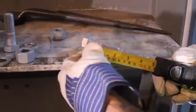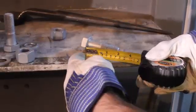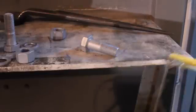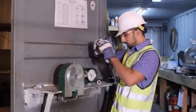First, we will measure the length of the bolt from its head to the end of its shank. This measurement is required to determine if the long bolt test or the short bolt test should be used. For a three inch long bolt, the long bolt test will be used. We then place the bolt in the Skidmore machine.